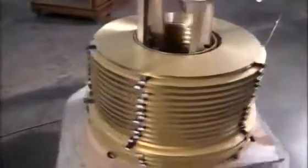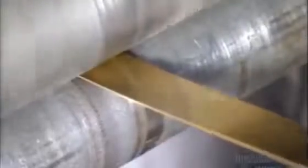Once they've carved out plenty of niches, they move on to the perimeter of the wood. They cut grooves along the length of the wood to install a brass binding. But first, they unwind the binding into a forming machine. Rollers flatten it to get rid of the curl from the coiling. Other rollers then crimp the brass. The process will allow the strip to fit into those grooves on the level's wooden casing.